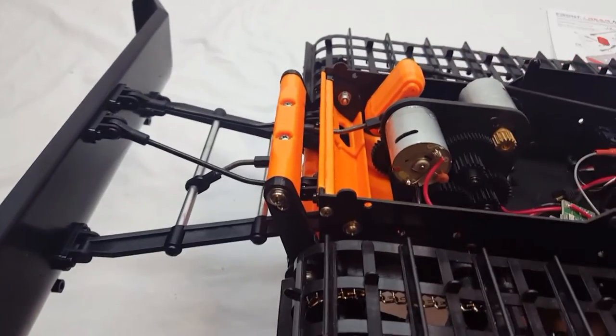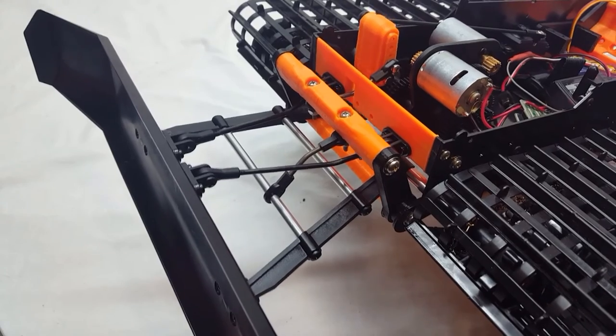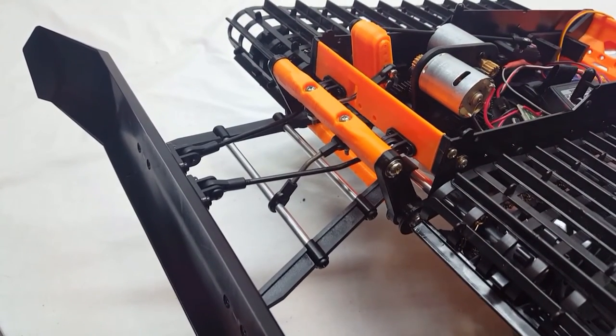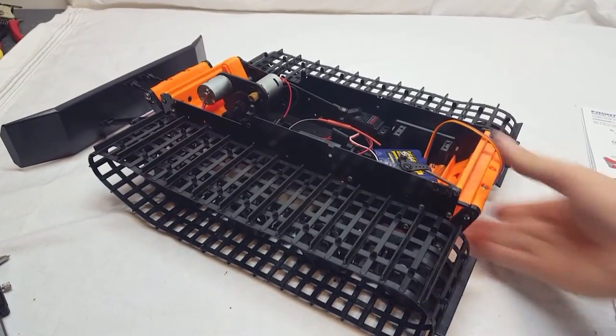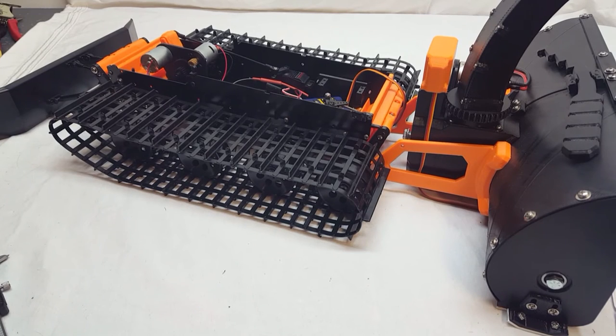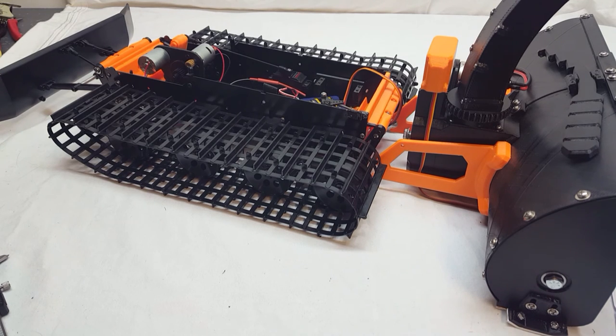When you want to use your snowblower you'll basically have to remove three screws — these two here and then this one — then pop those out of the joints and you can fit the snowblower right in its place. Another thing you can do: I designed these mounts so you could use the snowblower on one end while you're using the plow on the other end, so you could go in reverse to use the plow or forward to use the snowblower, which gives it a lot more useful functions. That's also another reason to get both front and rear mounts — it gives you a lot more flexibility with the whole blizzard. That's all there is to it, thanks for watching guys.